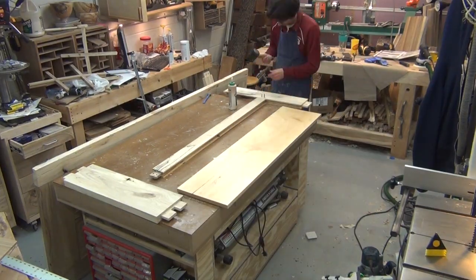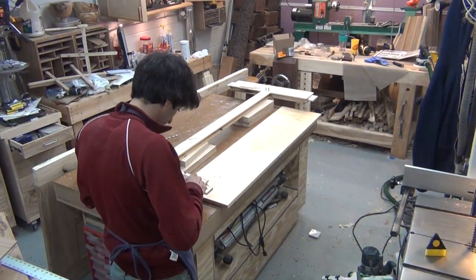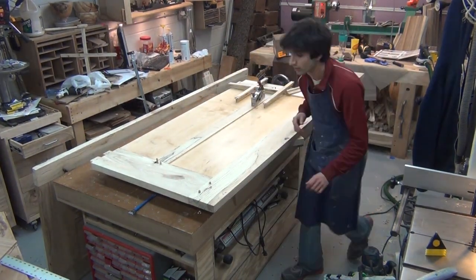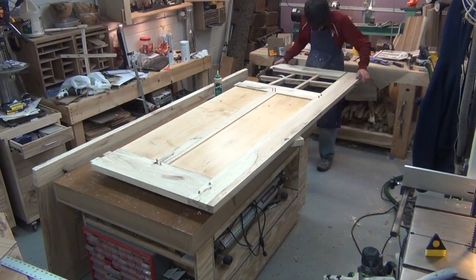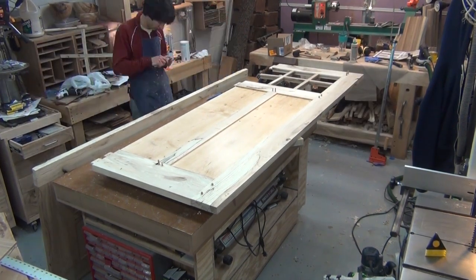So this week I started off by removing the panels from the door and pre-finishing those. They both have 2 coats of finish on them before I assembled the whole thing. I assembled the doors using a drawbored mortise and tenon. If you're not familiar with the draw boring technique, there's a video from Worth the Effort which goes into great detail regarding this topic. I'll put a link to that in the description so you can take a look at that if you really want to know way more than you ever wanted to know about draw boring.